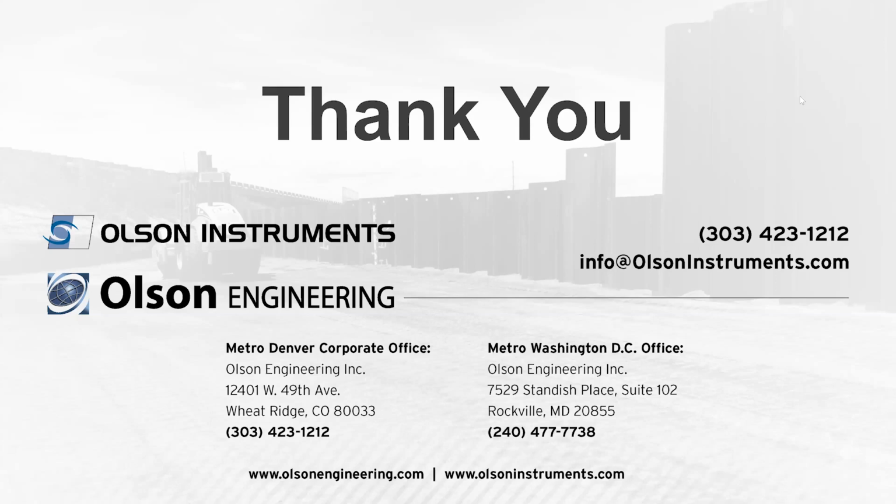Someone wants to just go over what your moisture source is again. To measure moisture, the University of Maryland study looked at Decagon type devices. They looked at the Ohaus meter, which can do it in about half an hour in the field. Indiana DOT has used that as well. But Indiana ultimately decided, there's pros and cons to the Ohaus. They ultimately decided they would do an oven moisture content.